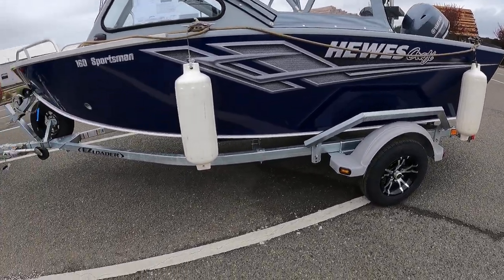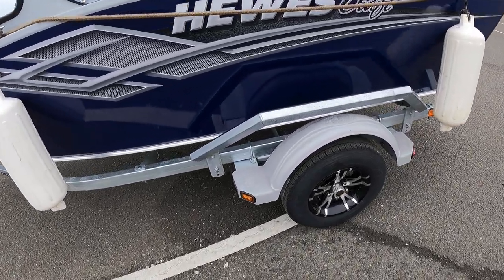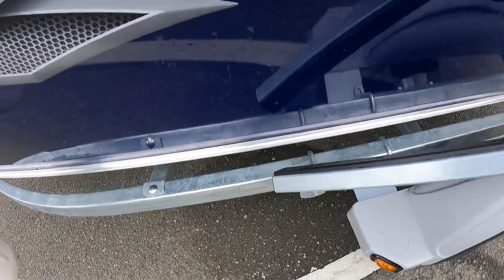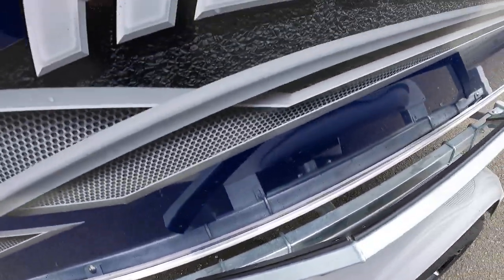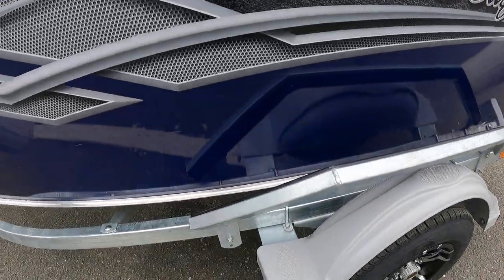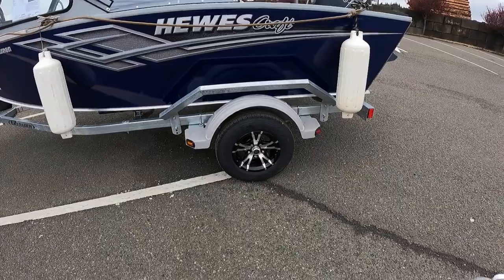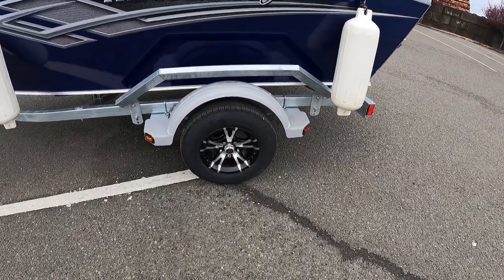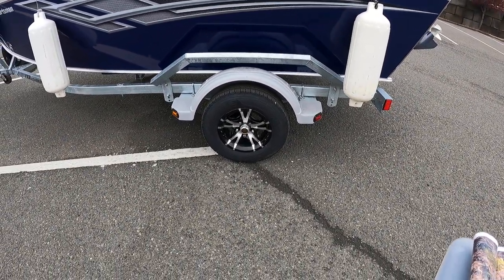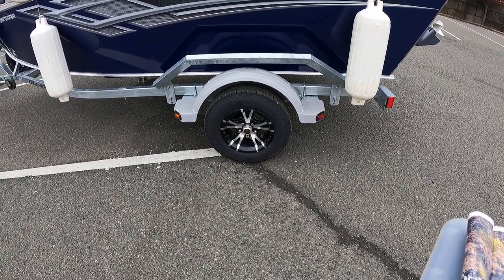And you got a double dip galvanized trailer. Really, really nice. You got a chine guide single axle. Chine guide, so it doesn't rub on the side of your boat and scratch it up. Pretty. And you don't have lag bolts, hangers, and all that stuff. You don't have to worry about rotting on you. You got mag wheel, black, with the aluminum outside. You got gear bath oil hubs, brown good, white bad, 5 lugs, 80 pounds.